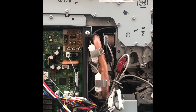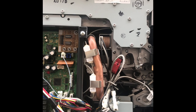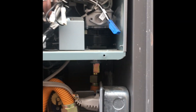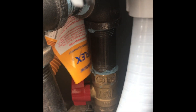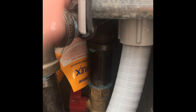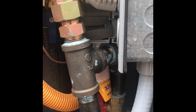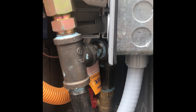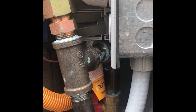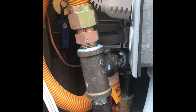Error code 11 has various causes. First: do you have gas going into your heater? This applies to both indoor and outdoor units. Check that the red valve is in line with the pipe — that means it's on and gas is flowing. You can also confirm gas supply by turning on your gas stove or natural-gas fireplace. If those are running, that also confirms there's enough pressure and volume coming to the unit.